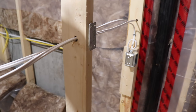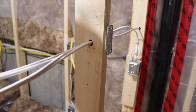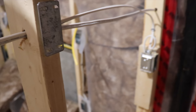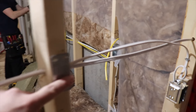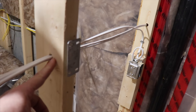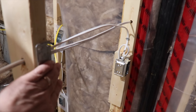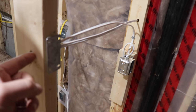Here's another cool electrical trick. Whenever you're doing your electrical they run it through the walls, but in the areas where we're putting drywall — like the bathroom — we're going to put these metal blanks. Trevor was saying that's there just in case the drywallers try to put too large of a screw in and accidentally hit the electrical wiring. This protects the wires from getting damaged — a super handy trick I had no clue about.